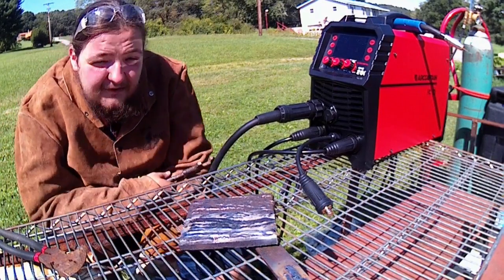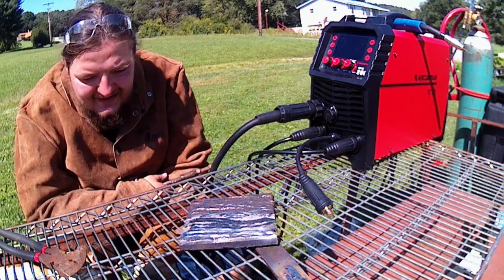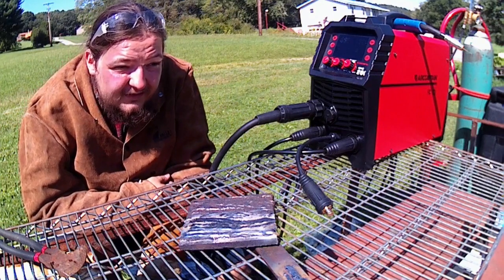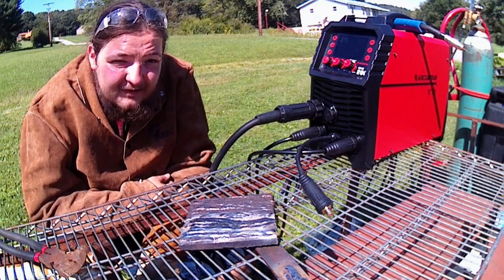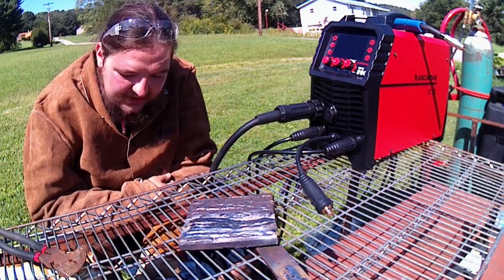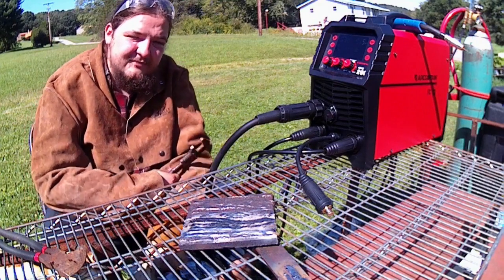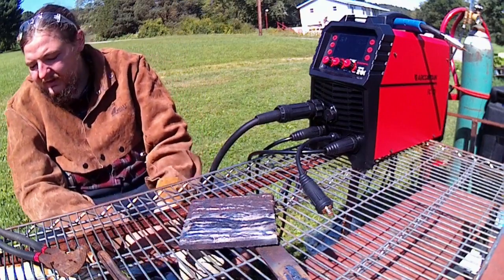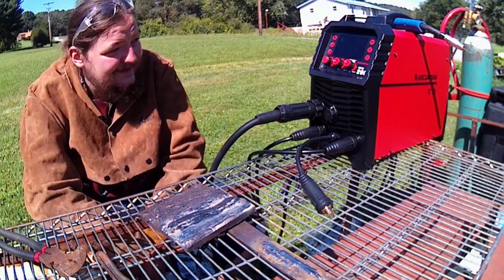Now, the exercise we're doing here to fill this up is called padding beads. It's a standard exercise to do when you're learning to weld. I do it in school with our students all the time. Have them sit down and just pad beads for days and days and days. That's how you get the idea how to run the rods right. Same thing with MIG and TIG. This is one of the best ways to do it. So, next up, we're going to hop over to 6010.